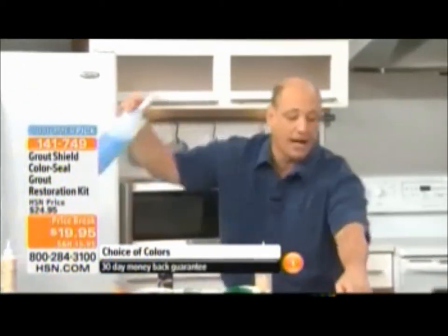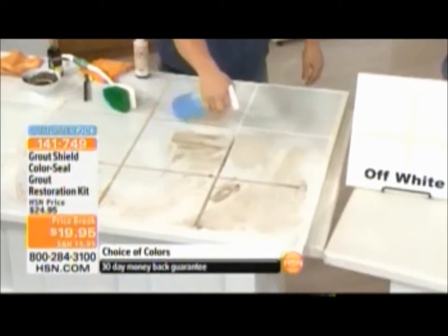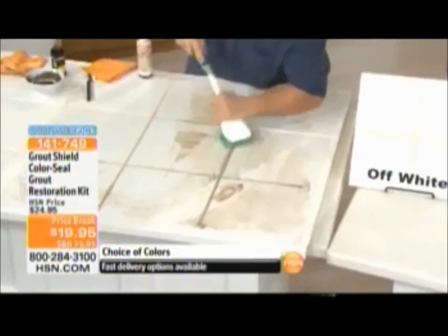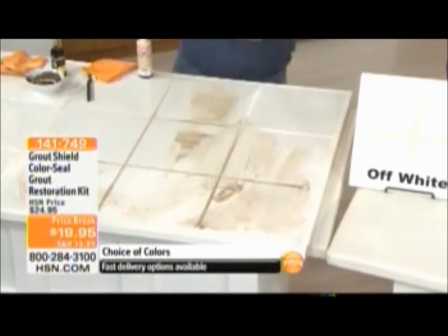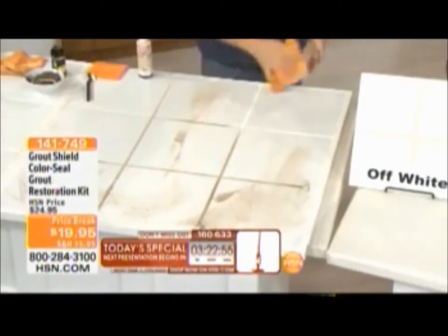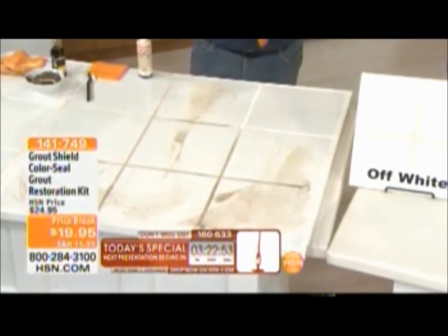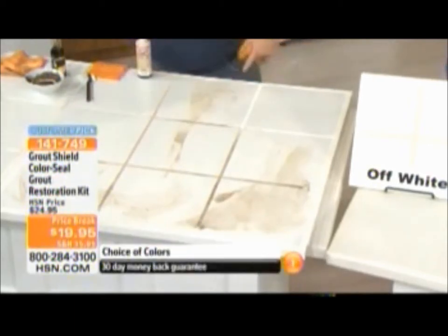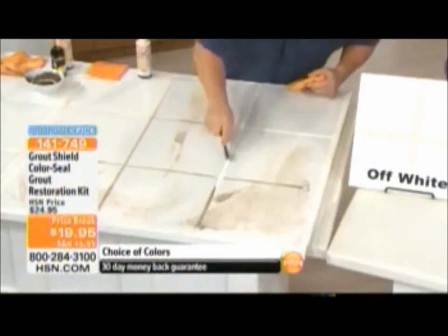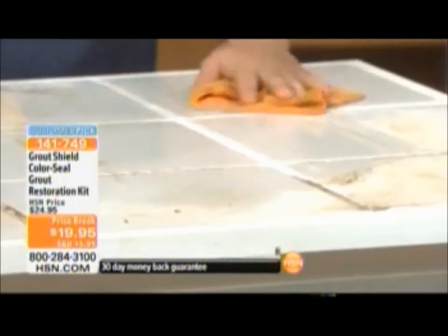If you want to change the color of your grout, come over here. This is mud that's been dried and caked on. I'm going to do the white — taking the mud from outside, dried overnight. Scrub the cleaner into the grout — it just breaks it down enough for the sealer to bond with the grout. Once it bonds, the sealer has a chemical reaction with the grout and hardens in the pores. Now draw a bead of the white down — a little bit of product goes a long way. Scrub it in with the brush.